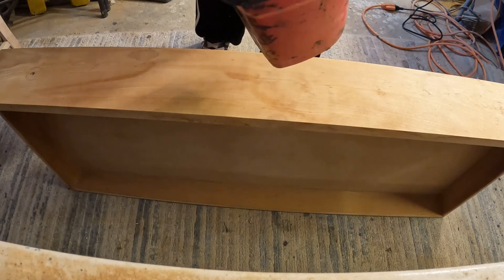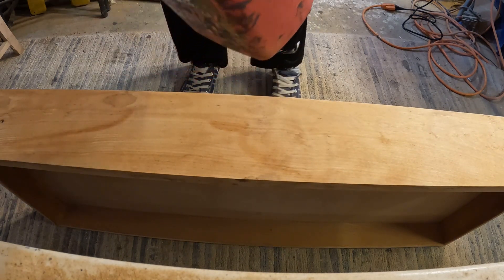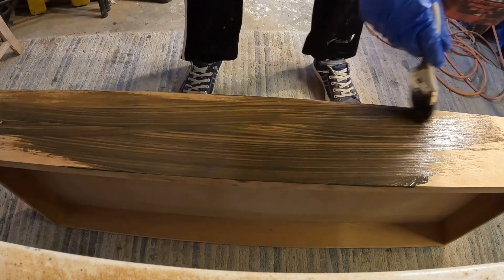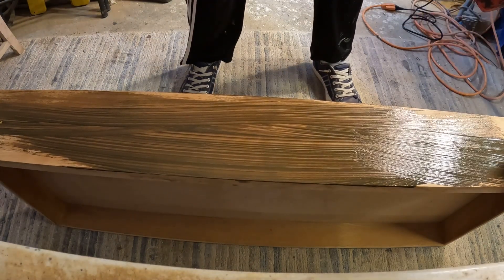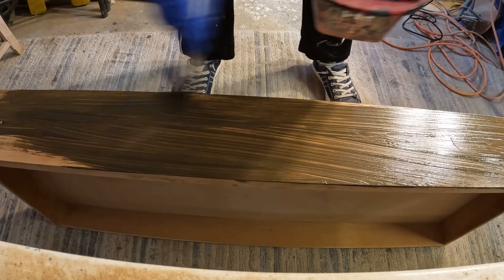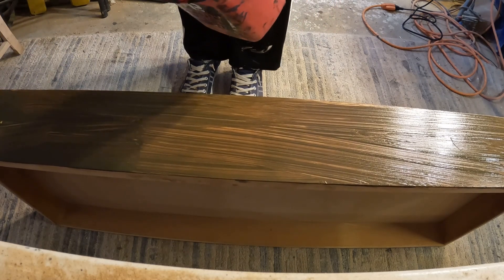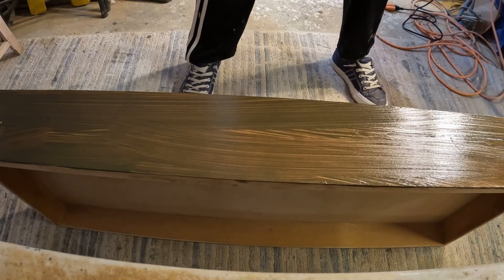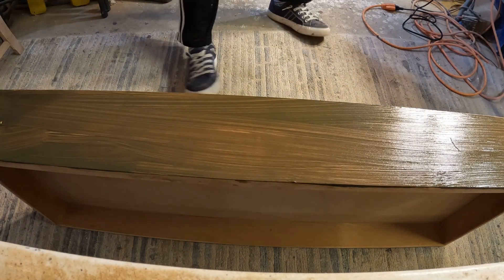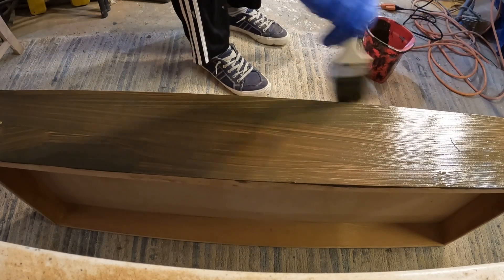I'm shocked to see it looks like a muddy green, and it kind of freaked me out. This is a water-based stain but it looks thick like paint and it looks green. I'm sure it's what they said — it's in the color driftwood. So I took the smallest drawer again and rubbed it all over. I looked at the directions — it said two minutes, and the open side of the symbol was toward two minutes, so I just focused on the two minutes. I did do a test because, I mean, look at it — I was freaked out by it.